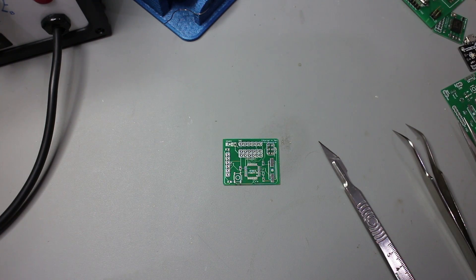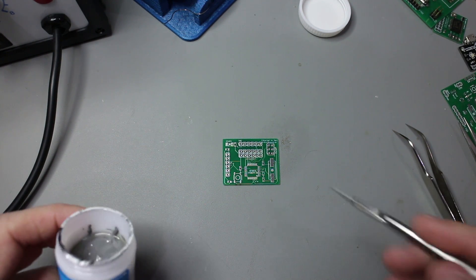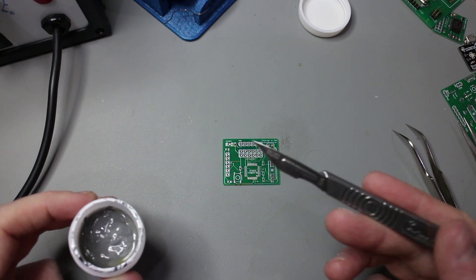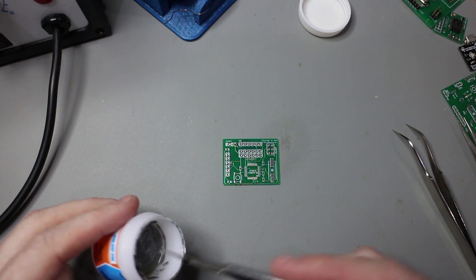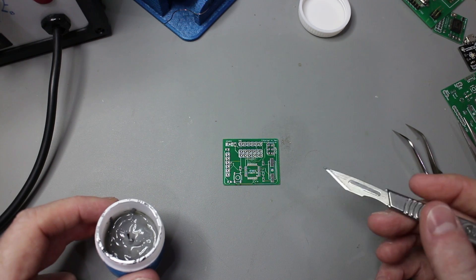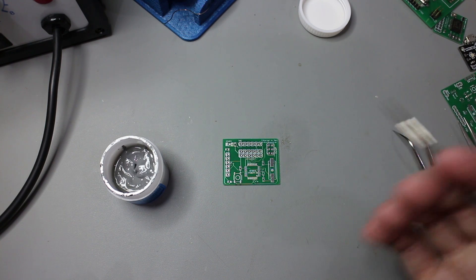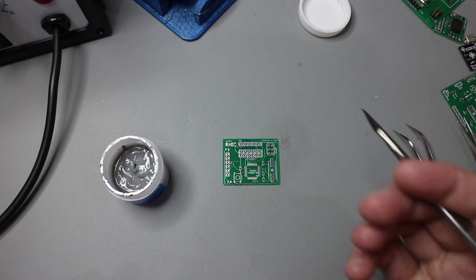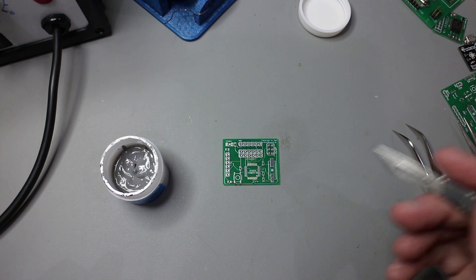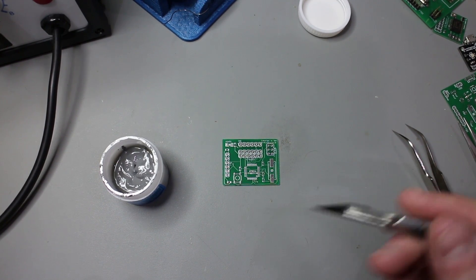This is the circuit board for the Serial to Ethernet adapter I've been working on - this is version 2. What we need to do is apply paste to each of the pads. The method I use for that is a knife, dipping it into the paste and going around very carefully dabbing - it's a time-consuming process, but it does work. I've ordered some solder paste in a syringe, but the ideal method is a solder paste applicator tool, which is an air-powered tool that dispenses just the right amount via foot switch or trigger. But those are a couple hundred quid, so I'm sticking with this method for now.